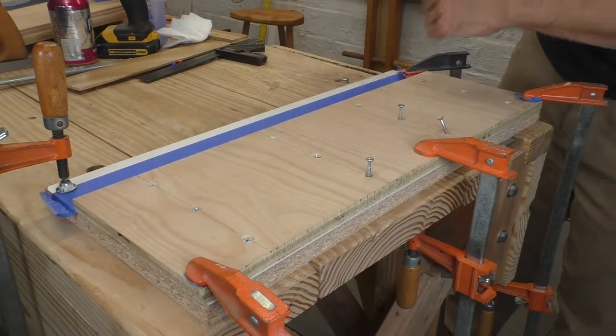So my new board will have a second fence that's both adjustable and replaceable. My new shooting board is great for cross-cutting, and I've actually stopped using a bench hook for sawing — it's much better to have one appliance that lets you saw the piece and then immediately true it up with the plane. I want an accurate fit between my two fences. I've got a bit of a gap, but it's easy to plane my second fence a little bit and get rid of that wobble. When the front of my fence isn't exactly square, I can adjust that too. It's worth taking a little extra time to get things really perfect. To hold my adjustable fence, I'm using cheap furniture hardware — you can pick this up at the big box store, and you could also just use a couple of machine screws or nuts and bolts. Anything threaded will get the job done. I drill my fence, place my screws, and then give them a tap to mark my drilling location on the board.